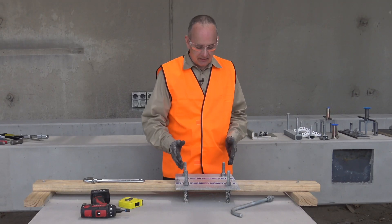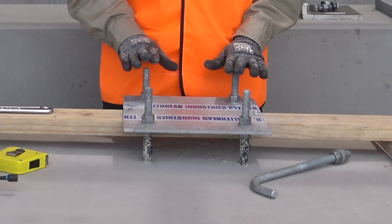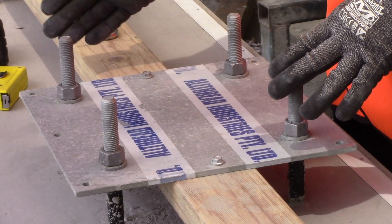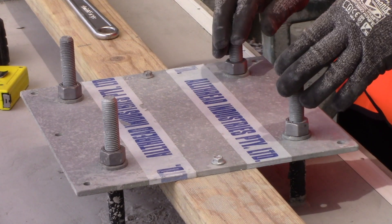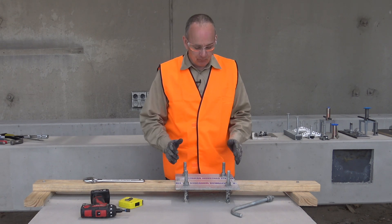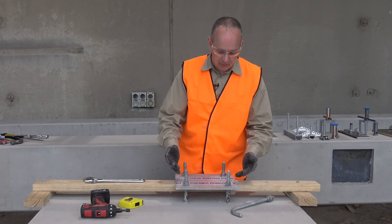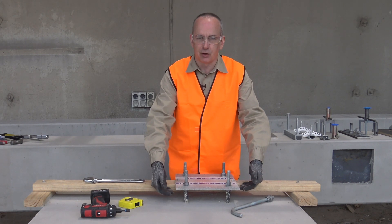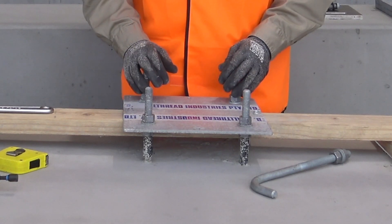We have L-bolts mounted about a steel template. What we're assured of with this configuration is a guaranteed placement of inserts with respect to each other along a continuous line — a really good way to do sets. In this particular case this would be an ideal configuration for picking up a base plate for a column. As you can see, we have plenty of thread available for mounting our base plate down and for giving us adjustment to get our level right, and also enough room underneath to apply a structural grout if that's called up in the specification.